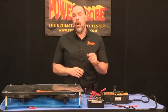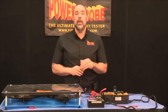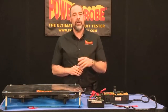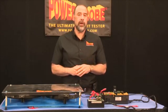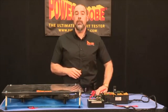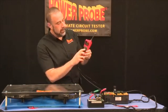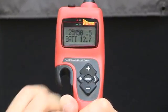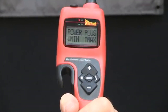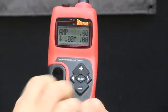After you've identified that no unsafe condition exists, or possibly this condition is normal for the circuit, just switch to Power Plus mode. Once in Power Plus mode, you can supply current to the circuit without arc detection mode. To get into Power Plus mode, press the select button, then press the plus button once, then press the select button again. You can see the Power Plus min and max is on. Press the select button.